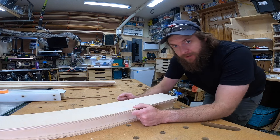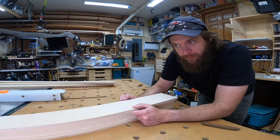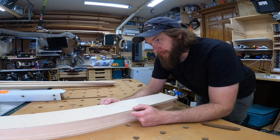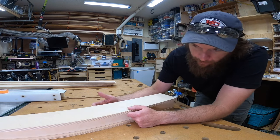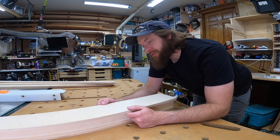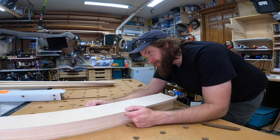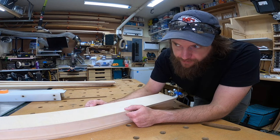So the question right now is: do I want to do this the right way or the easy way? This is going to be above a bunk bed, not visible from below, and there will be books on top of it. So if I use glue and screws, that'll be really quick, extremely solid. The alternative would be a couple rabbets and a couple dados, which I just don't feel like doing. Maybe I should do it — it won't be hard, it would actually help align it. It's a change of plans: I'm going to use dados and rabbets.